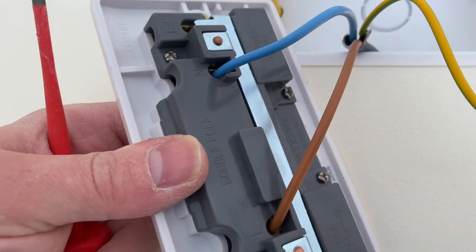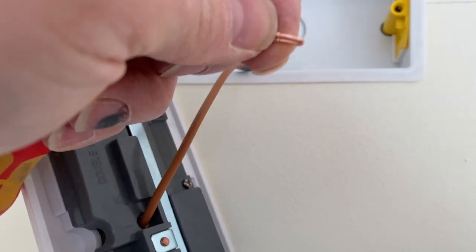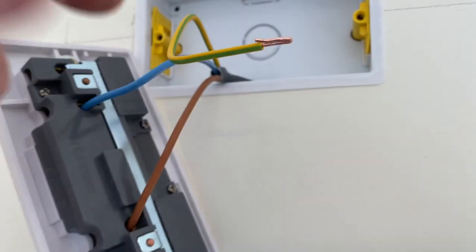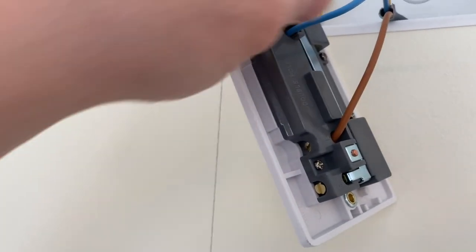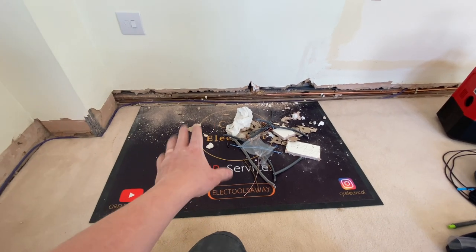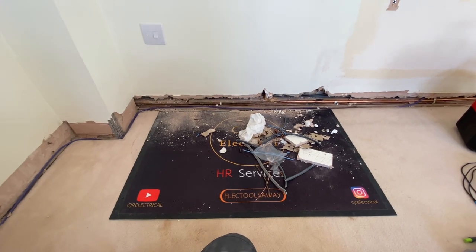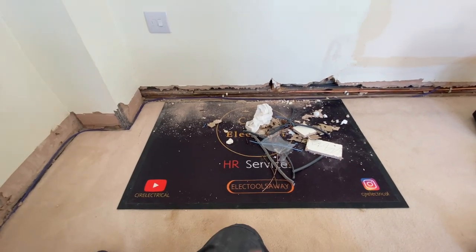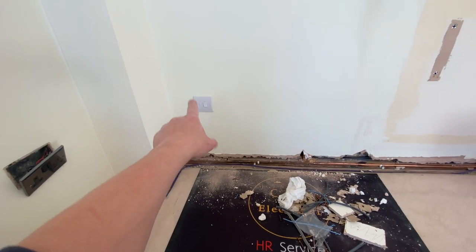I'm making off this socket. I've seen some chatter recently about not doubling cables over - but when I did my AM2, if you didn't double these over you would have failed. Single cable, you double over to increase the cross-sectional area. Otherwise if you just put a little one mill in there, the chances of it pulling off are quite high. These mats are from Paul at PRS Supplies - check out his Instagram and website.